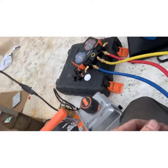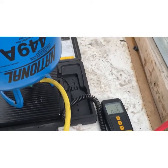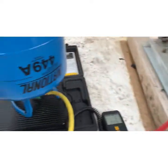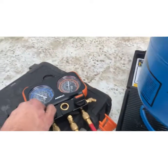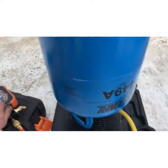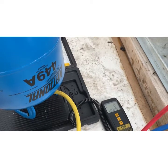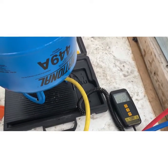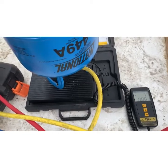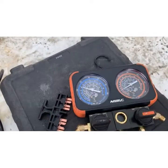This unit does not indicate how much refrigerant it takes — just that it's R-449A both inside and out. So we're going to bleed it in. I'm guessing it's going to take six or eight pounds. I'm going to slowly bleed some gas in here, then get the unit fired up. I'm still disconnected downstairs. I'm going to fill it up until I get enough pressure that the unit will run when I ask it to, then go downstairs and turn on the breaker. I'll probably bleed in four or five pounds just so I know it can safely operate.